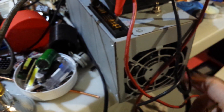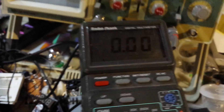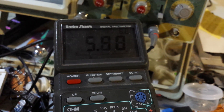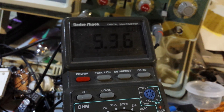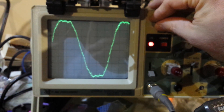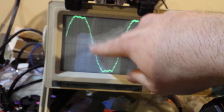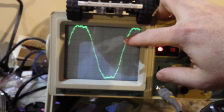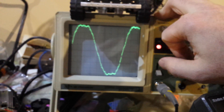Enough of me talking, I'm gonna start it and you'll be able to hear the noise. There is a little bit of loss in my multimeter leads but it won't affect it much. Power on. No load it's stabilized at about 5 to 5.3 amps. This is the scope shot — it's not perfectly a sine wave. I'm assuming the brushes are probably just a little bit dirty, so I'm going to open it, clean the bearings, clean the brushes, and see if I can get a cleaner waveform.